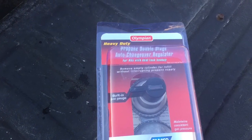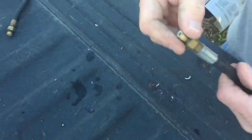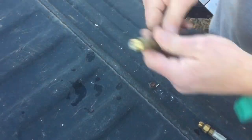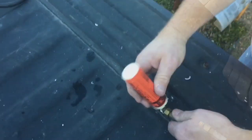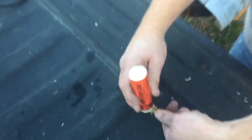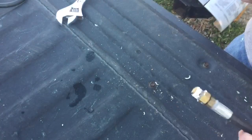Here's a look at the new valve that I purchased online and I'm going to get started putting this one together. But first, I want to make sure I clean off the threads — it's got thread tape on it. Make sure I get all the old thread tape and pipe dope off there. You can use pipe dope or pipe dope in a can, or you can go with tape. Make sure that it is rated for gas if you use tape or any pipe dope.